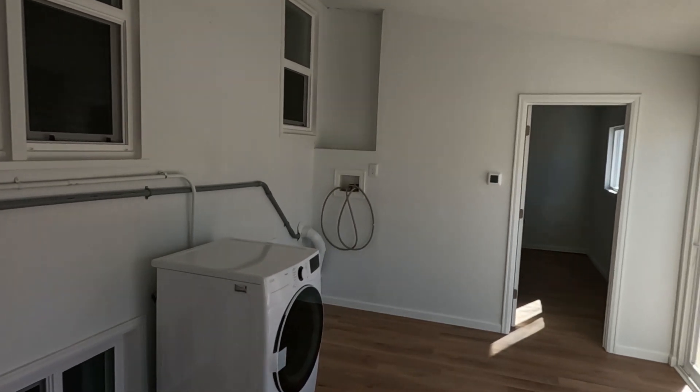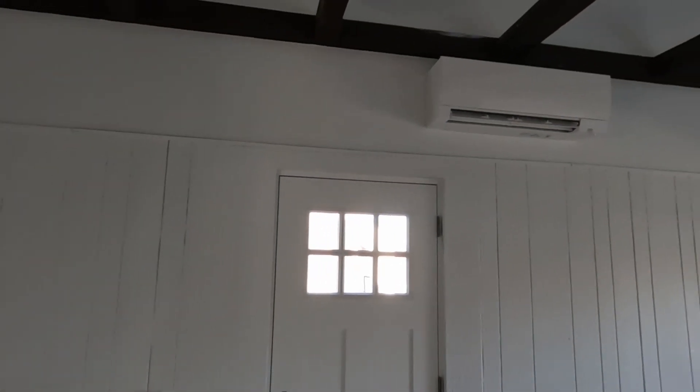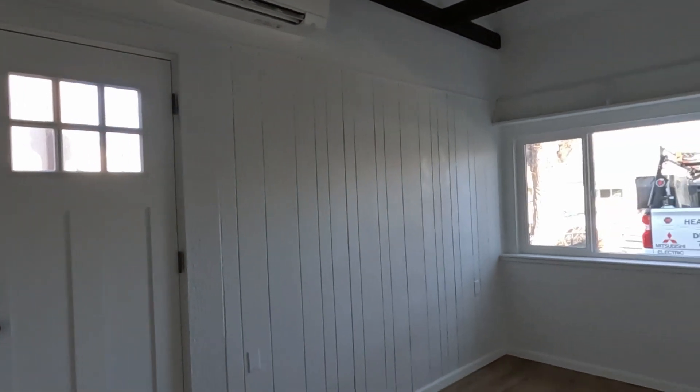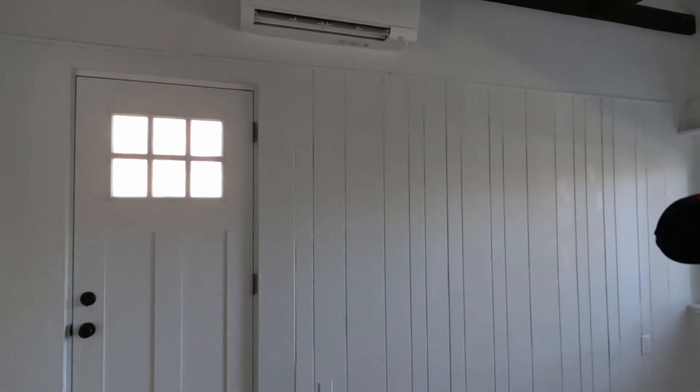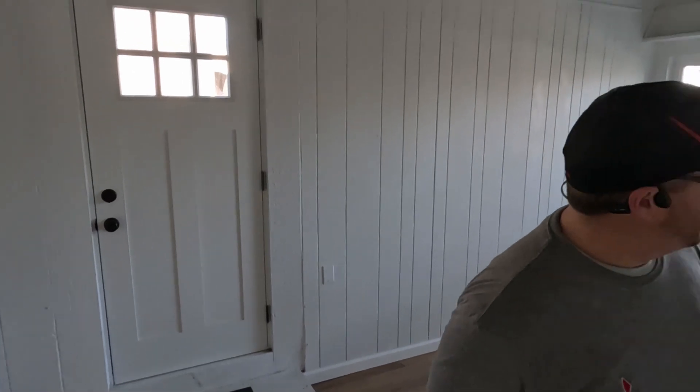This one does this room. This is a little 6,000 BTU unit — it's perfect for this room. A 6,000 BTU FS head is the smallest they make; you can't get any smaller. They do scale themselves, so it can scale all the way down to whatever BTU it needs. A 6,000 really doesn't need all of its capacity — it can drop itself a little bit. This whole addition of the home had no heating; there was a fireplace here but they removed it. Anyway, it's all cleaned up — we're out of here.